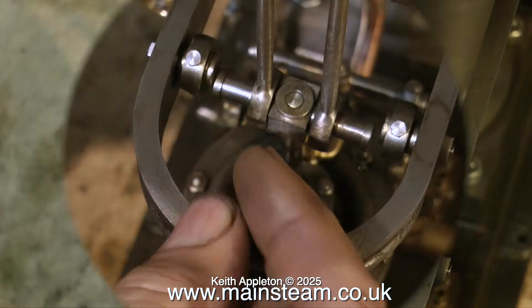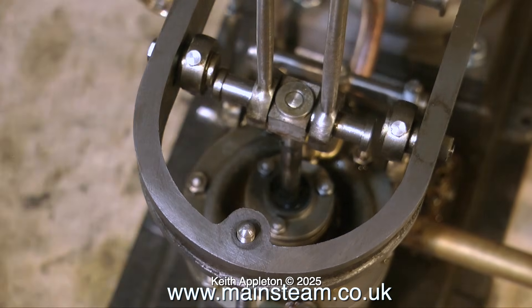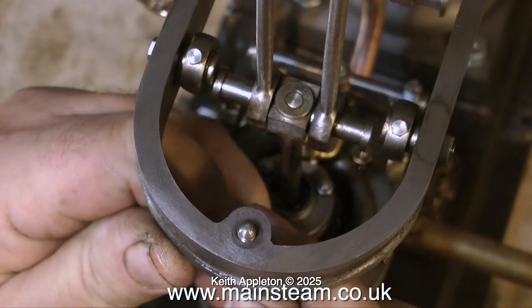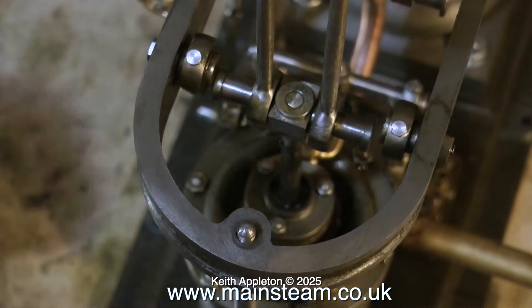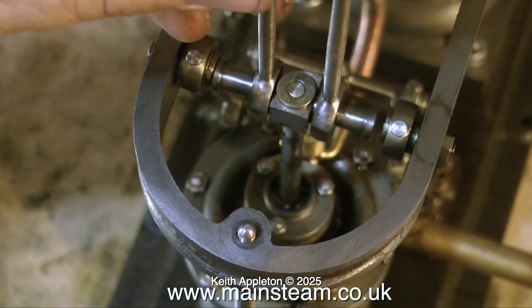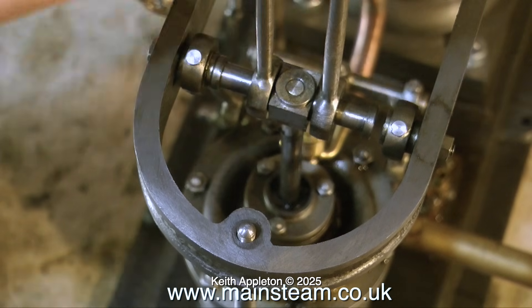It's almost as though it's in the wrong place, so I'm going to have a look at this to see how tight this support shaft is. I'm beginning to figure out the puzzle, I think. I don't actually know what all the parts are called on the beam engine because I don't work on them very often, but this horseshoe shaped piece of metal is in the wrong place — it's pushing over to the right hand side. If I take it that the cylinder is in the correct position, which it is, because cast into the bed plate is a mounting flange.